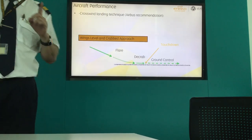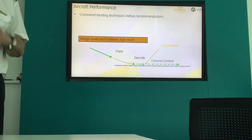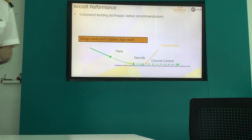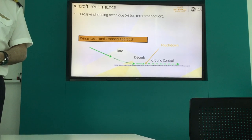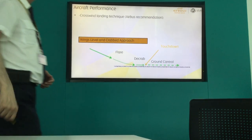But be careful — the flight control computer can do the job correctly only up to 20 knots. Beyond 20 knots, you cannot do an autoland, because it is limited to 20 knots. Those are the limitations on the flight control computer. Everybody knows the autoland is limited to 20 knots.